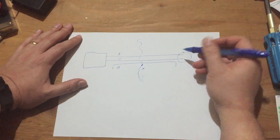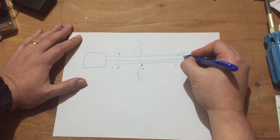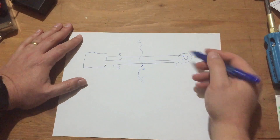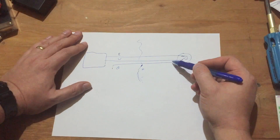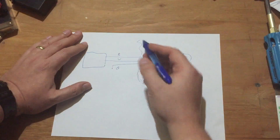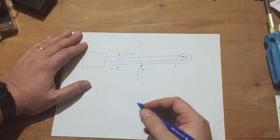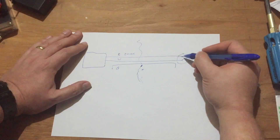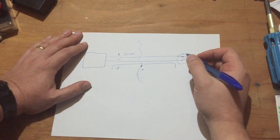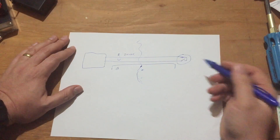The way this is working is that the existing thermostats are really simple — they're basically just a switch, a temperature-controlled switch. It doesn't matter which way these two wires are connected, the red and the white, because all that happens is that one of these has power. The red is supposed to have 24 volts AC, and the white is what controls the heat. Connecting the 24-volt supply to the white wire turns on that zone. Because it's just a simple switch, connecting white to red is the same as connecting red to white — it doesn't matter.